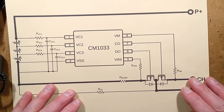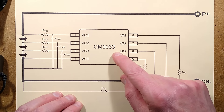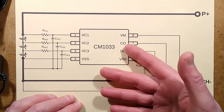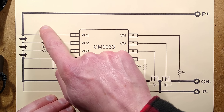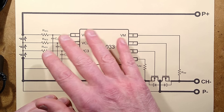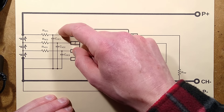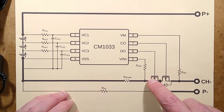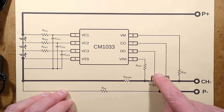After this we will open up the tool and see what the construction is like inside. Here's a CM1033 — a more common chip found in these battery packs. There are the three lithium cells, those three 1k resistors, and three capacitors for monitoring the voltage across the cells, so it can cut out when either one reaches 4.2 volts or drops to 3 volts.